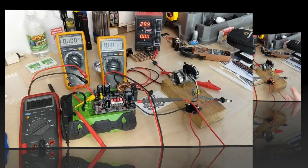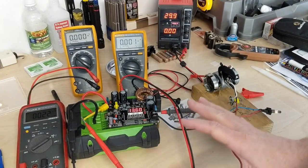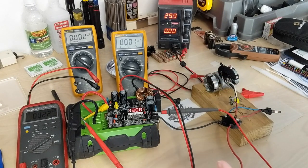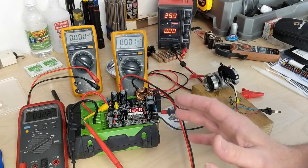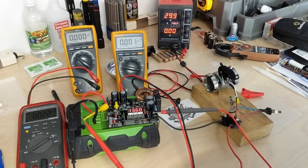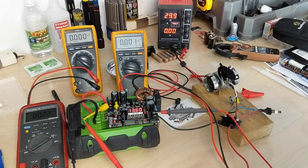The only other thing I wanted to test today — Jeff also mentioned that if the efficiency wasn't great he could run it off 24 volts. I noted it as 48 volts converting to 24 volts. We'll keep the input at 50 volts and try it at 24 volts output to see if we get a different efficiency calculation.